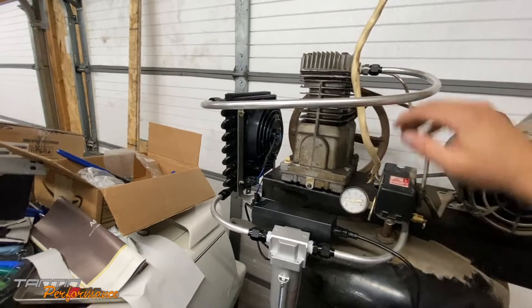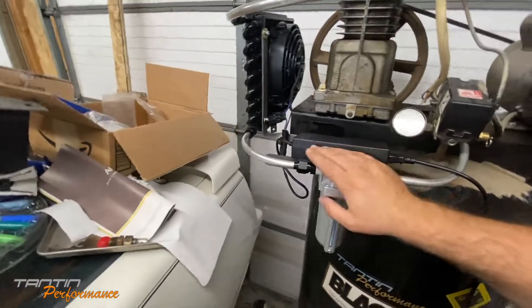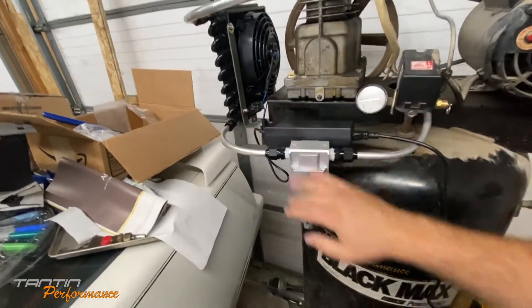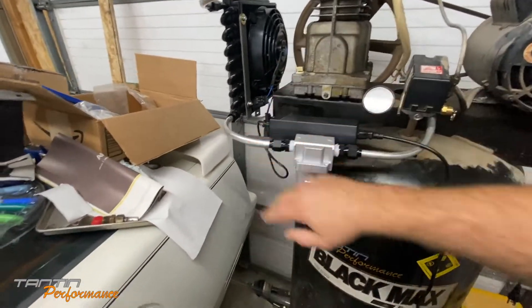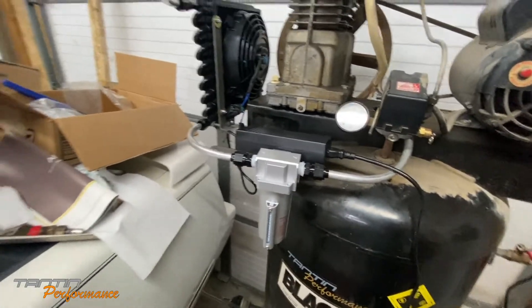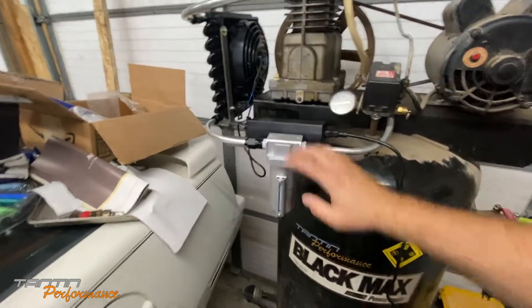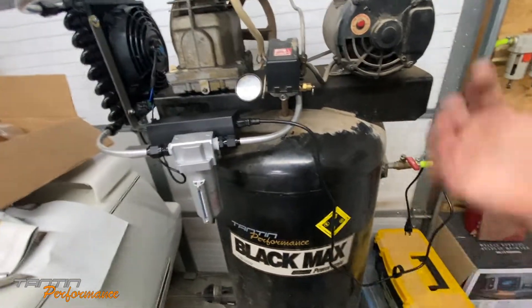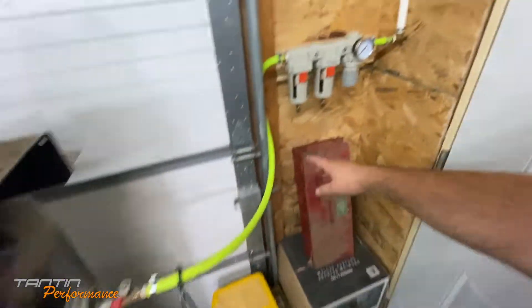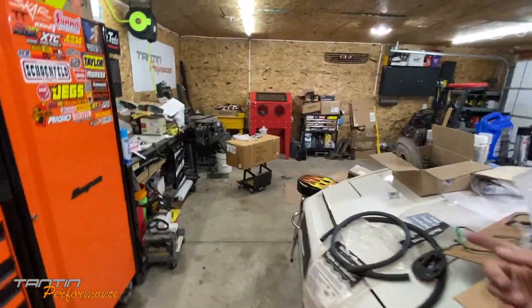All I have left to do is wire this in. It does cool down pretty quick though. This being a little above the radiator means there may be water in that section, but it'll cook it out or blow it into this. This should catch most of the water the system is making, help cool the air going into the tank, and keep moisture from building up in the tank. Then we have another filter set on the blasting cabinet itself to filter out some more.